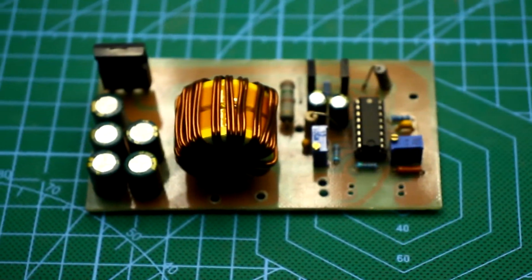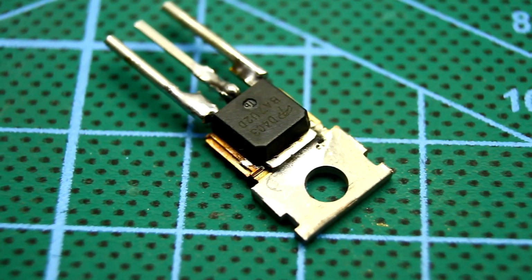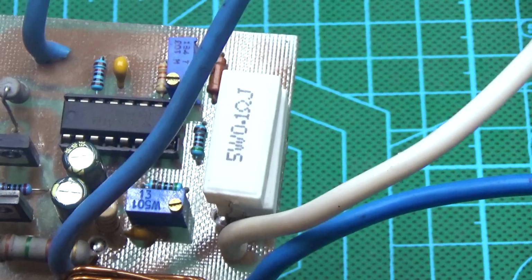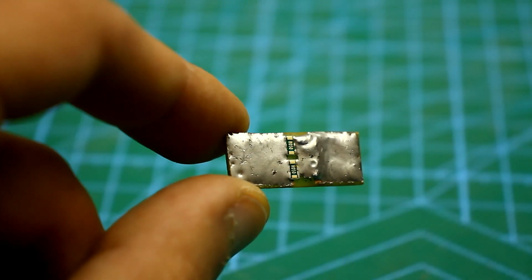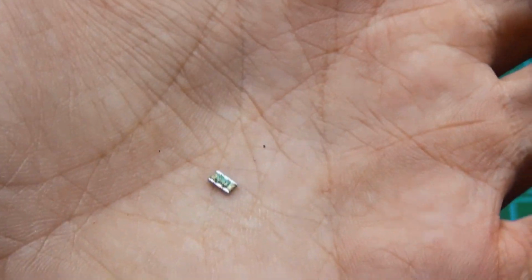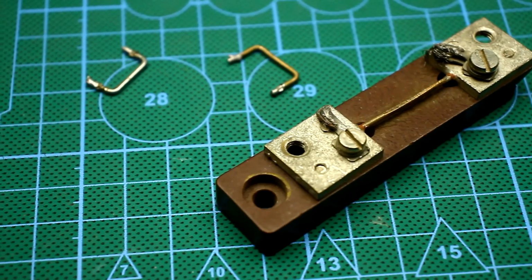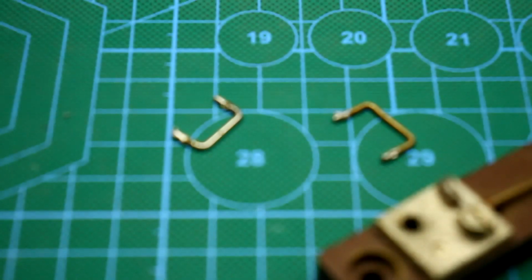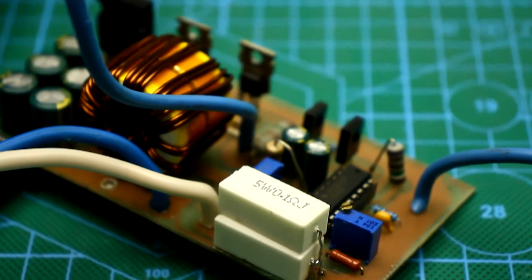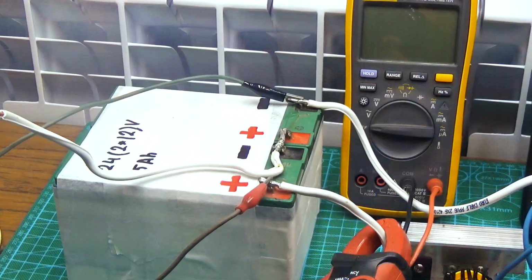What about the components heating up? And how does this stabilizer hold short circuits? Well, let's begin. Here I note that the shunt is already different. The ones that were installed initially burned immediately. However, this has already been mentioned. Of course, it is desirable to use a shunt of constantan or manganin. They will not change the resistance as they warm up. And these resistors aren't the best option, but they will fit if there is nothing else at hand.